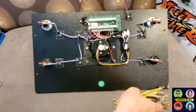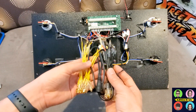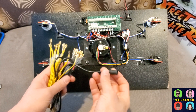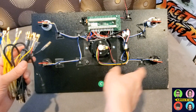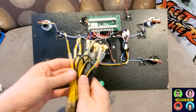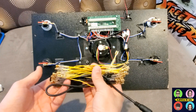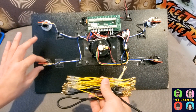I would recommend getting a pre-existing installed power wire harness — you can get this from DIY Retro, and other sellers carry it as well. This connects via a 12-volt adapter that you plug into one of your Y-splitters, then daisy-chains a positive and negative to each of your buttons. It's a much quicker, easier option instead of making this yourself — about nine dollars plus shipping — and it's a true 12-volt setting, which is what the buttons are rated for.